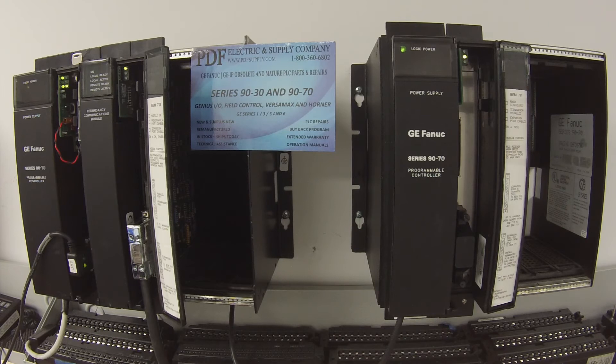For rack number one, I have the same thing: CHS750 five-slot rack, PWR711 power supply. Once you select the PWR711 power supply, an IC697BEM711 will automatically populate into Proficy Machine Edition. If for any reason it doesn't, you can always manually add it by right-clicking on slot one and selecting Add Module. Once that's all set, download and store that information and get your processor into run mode, as I have here.